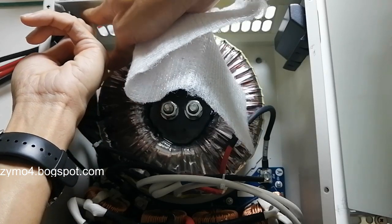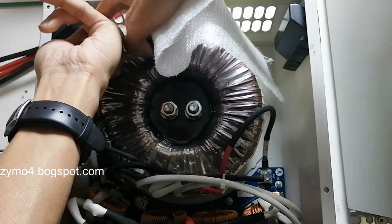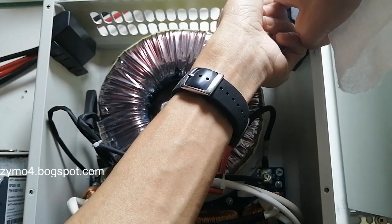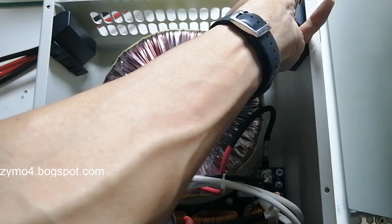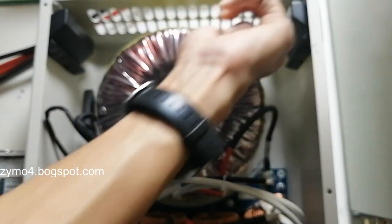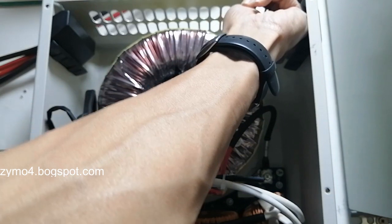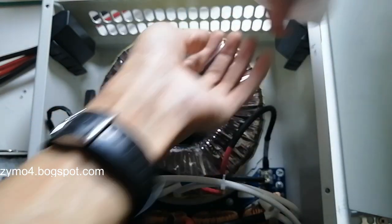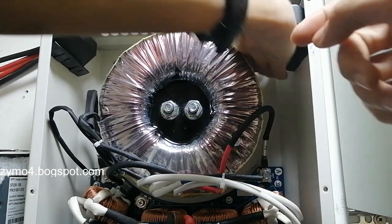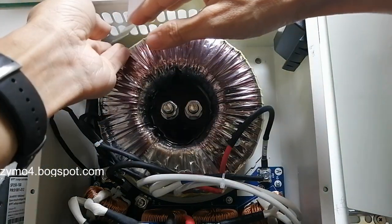because one of the main culprits, as I mentioned earlier, are lizards, especially the small ones that will go inside and touch your sensitive high voltage DC electronics, and that's it. Your inverter will fry. And the cost of repair is not that much, but the hassle of having it removed and shipped to your repairman or authorized repair personnel is very much a hassle.